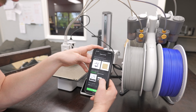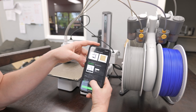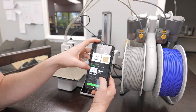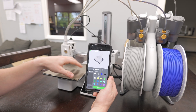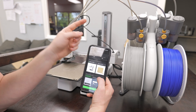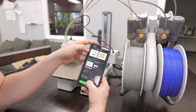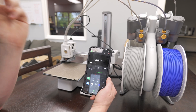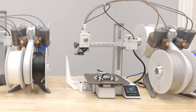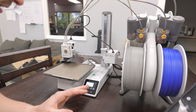We'll probably use white just because it'll sort of match the printer, and also white's probably one of my lesser favorite filaments to use. We'll do bed leveling — I like to use that for almost every print unless I'm printing a lot in a row and I know the bed's nice and leveled. We're only going to make one copy. You can actually go into the 3D view and see what it's going to look like — this is actually the build plate, so you can see this thing's going to take up the whole entire build plate. It's going to use about 83 grams of filament, take 5.5 hours. We'll also let flow calibration run — I don't normally do that one, but on its first try I don't mind. I'm going to head out for the day and let this start printing — I can actually watch this from my phone.